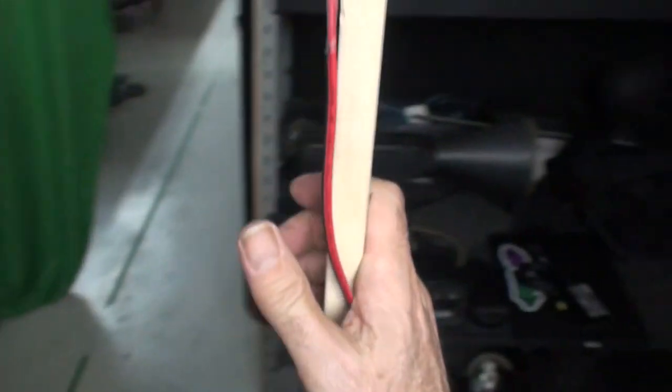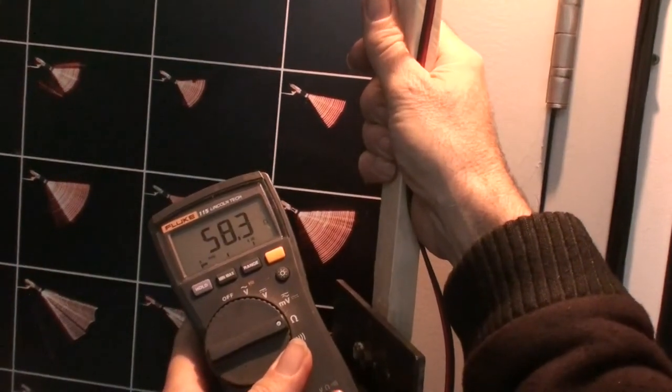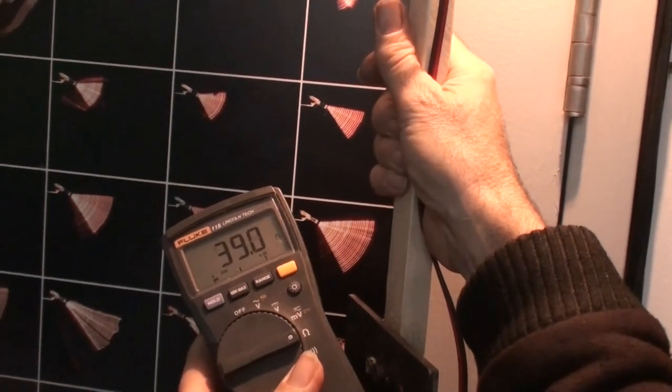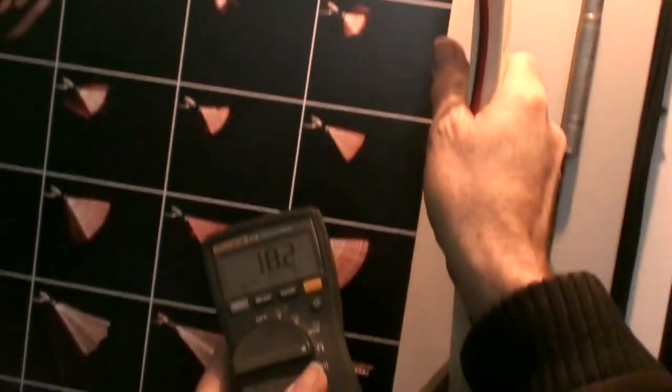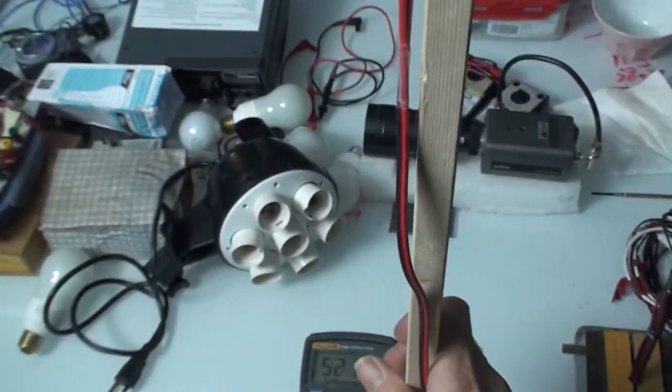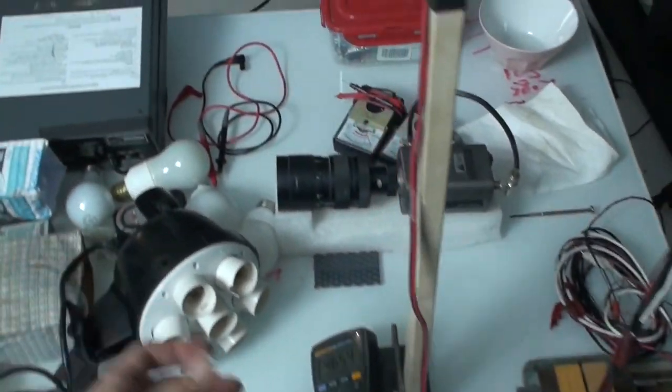And so this device measures light, and we can walk around with it and bring it in closer to the light, and as we come closer the resistance goes down, until we come right up close to the light, and now it's like 20 ohms or 24 ohms, 36 ohms, you know, it's varying around fairly low resistances when it's in close to the light. As we come further from the light, we'll pick up other light sources in the room, of course, but generally the resistance increases.